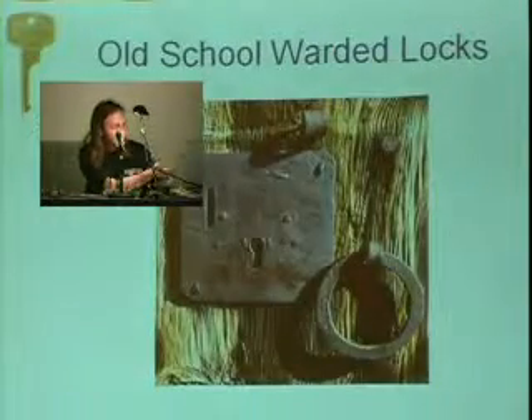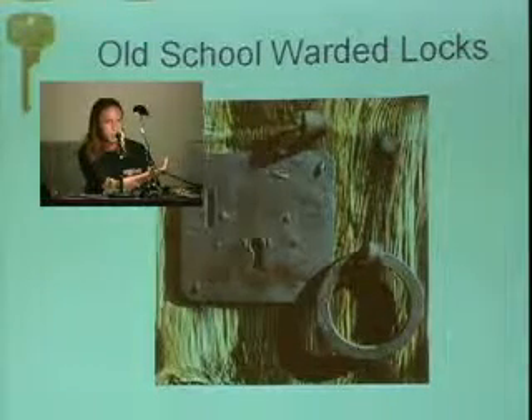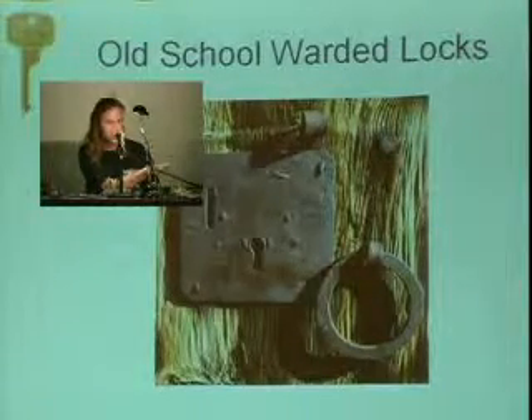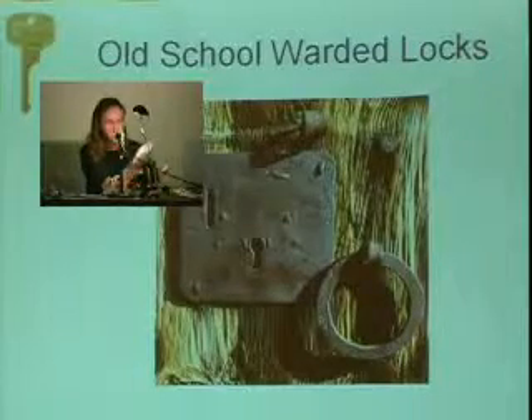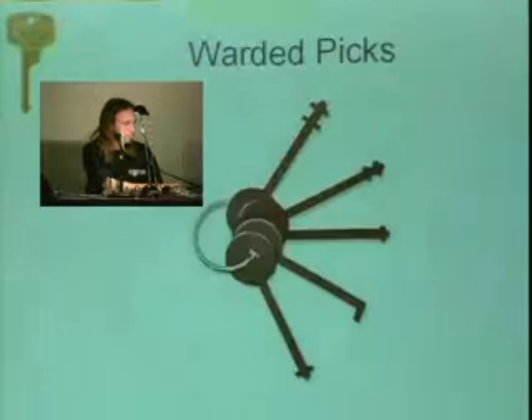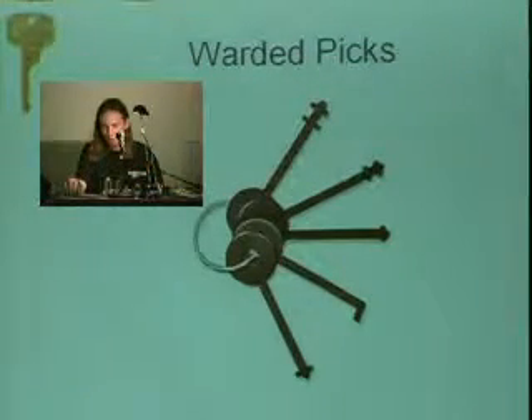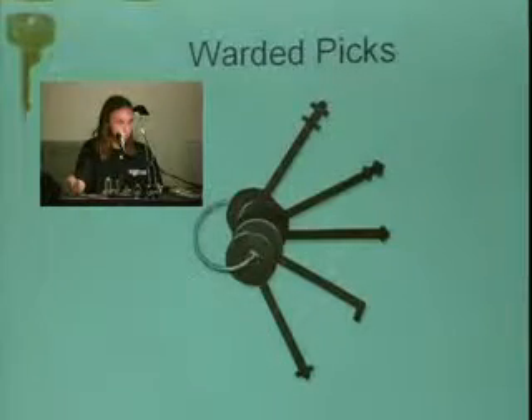It's good in outdoor areas where there's a lot of dirt and natural problems, whereas a pin tumbler would clog up and not be able to rotate all those springs into the right position. That's what it looks like on the inside — all you need to do is pop that latch out of the way for the shackle to pop up. And inside you can see these false wards which will prevent the wrong key from turning. The old school lock that looks like a big dungeon kind of key — that's warded.